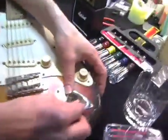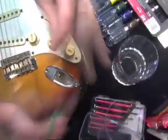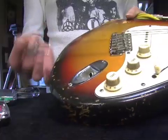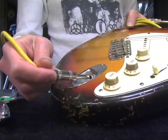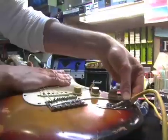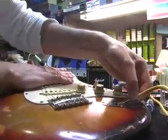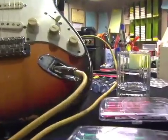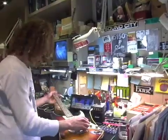And that's it — that is not going anywhere. Once that's done, you just put it back onto the guitar, line it up on the holes, grab your screws, and remount the assembly. It's really simple. At this point, the only thing you really need to do is test. Take the cable and put it into the jack and jiggle it around — you can feel it's tight, it ain't loose, and it's not moving. You hear the hum, which is normal, but there's no crackle. The jack is pretty tight. See you next month.